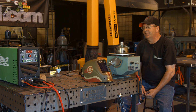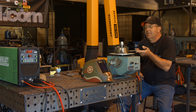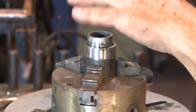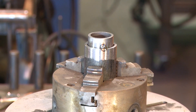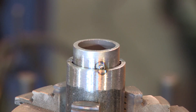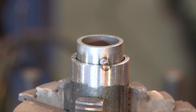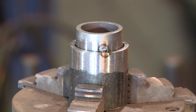I had one of my buddies call from Dallas. He's got some military parts he wants to bid on, and they're going to be chrome moly small tubes. He wants a small fillet weld in here. I've duplicated the joint configuration and I'm going to try to hit about a 0.9 weld around here. It's got 0.120 wall thickness on some tube. I know his parts are going to be machined 4130, and I just sanded these and fit them up as close as possible.